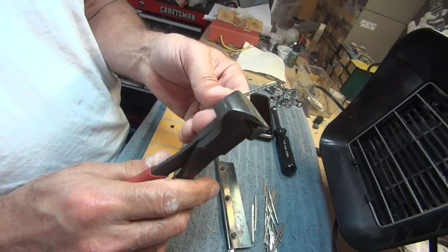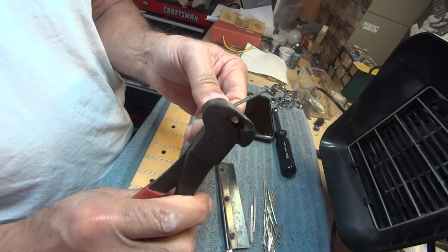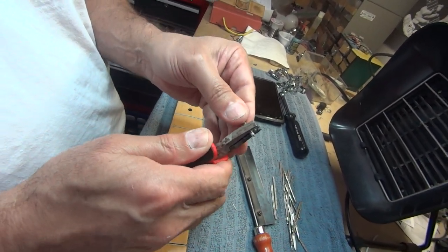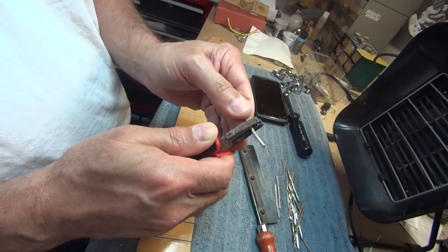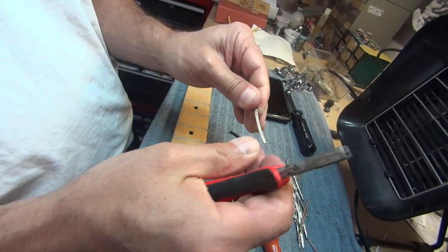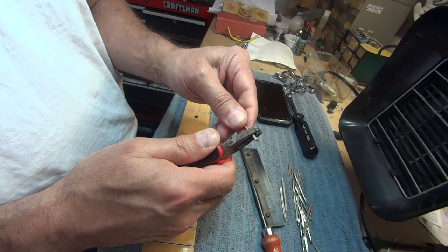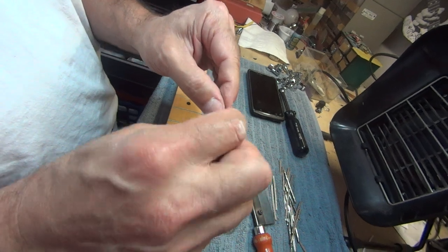So you do the tang twisting before you bend the fret wire. If you have to do it a little bit after, you can re-bend the fret wire by hand, like we used to do in the old days — you have to have a really good feel because you don't want kinks in the fret wire. Before fret rollers existed we bent fret wire this way. This is just an old piece of fret wire with solder all over it, but I'm trying to show you: you'd have your perfect radius, and that fret going in now is going to be real tight.